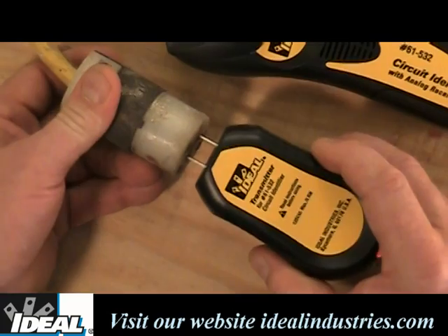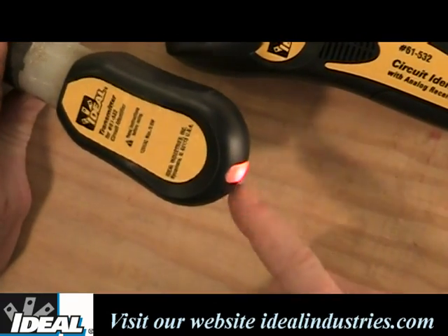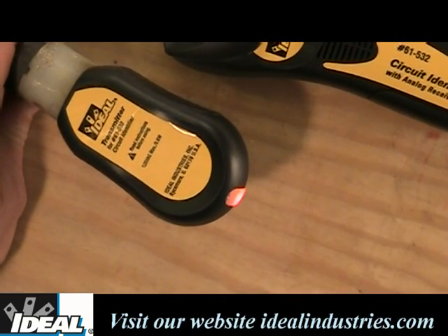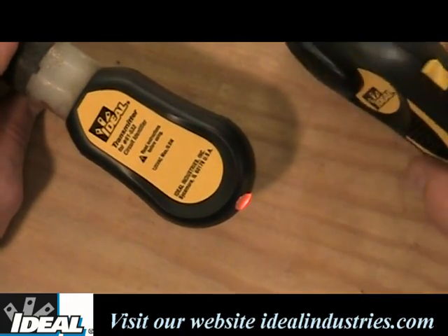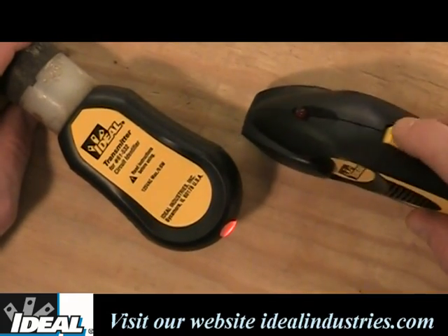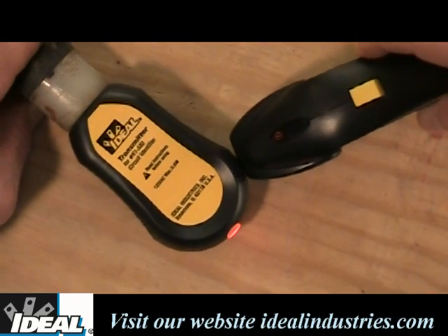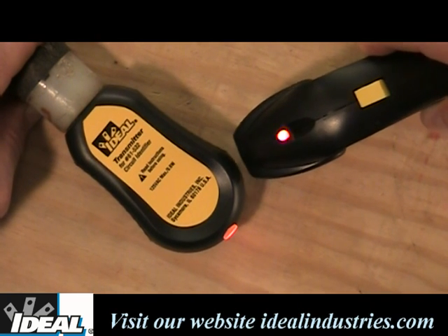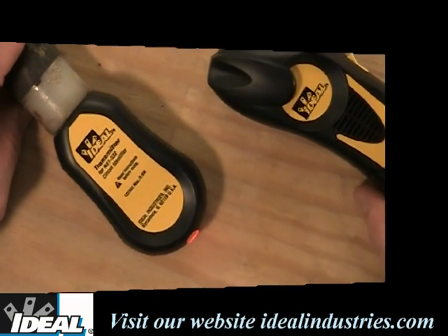Here I've got an extension cord running to the tabletop, and now I've plugged it in. I got a red light on the back of the unit here letting me know that it's working — it is on an active live circuit and it is generating this sound or tone that we can pick up with our receiver. If I turn my receiver on and hold it to the side of this, it's making noise, the light goes out, and it's looking for the sound as I move away from it. So let's go find this particular circuit back in the breaker panel.